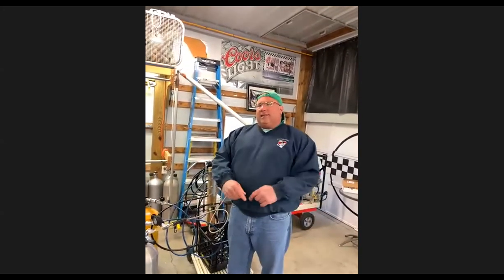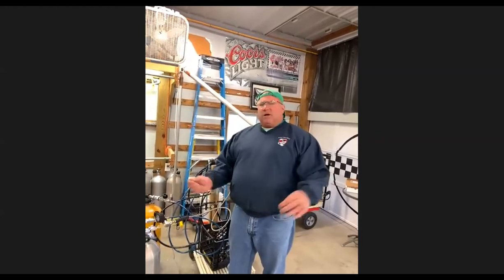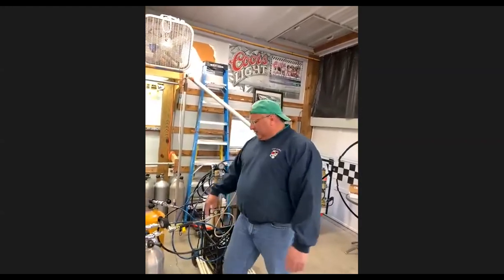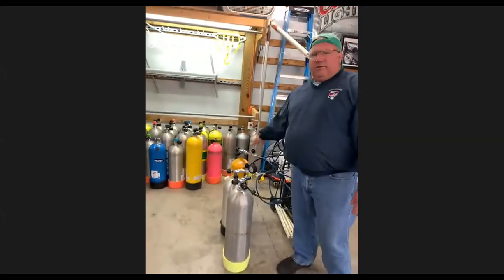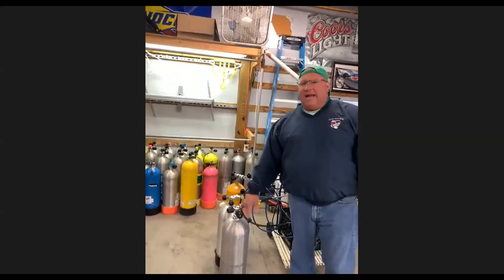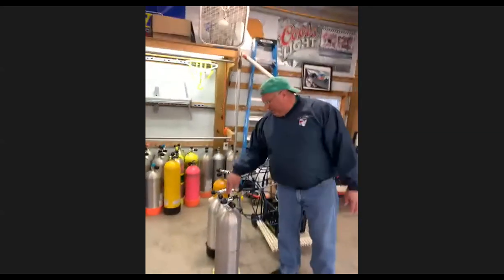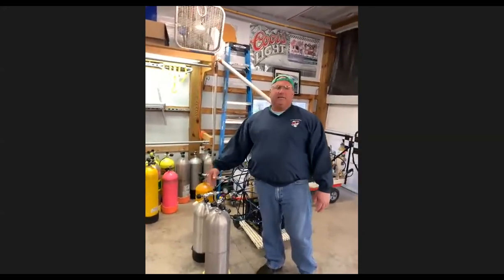Those gas laws come back to, I think Megan had that chapter. So if you have questions on that later, we can explain any of those. All right, so the cylinders are all filled. We fill the steel or the aluminum, 80s, 63s, 72s, they all fill the same. We're filling these with yoke. Most of our stuff is all yoke. We do have a way to fill DIN as well.